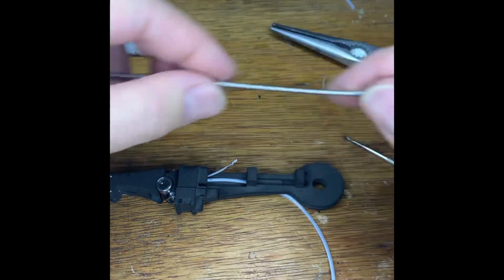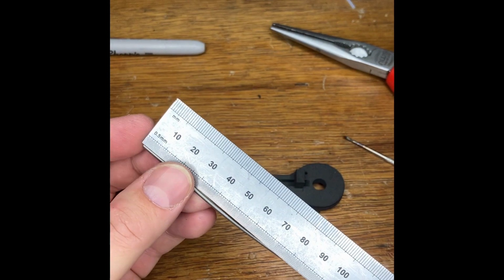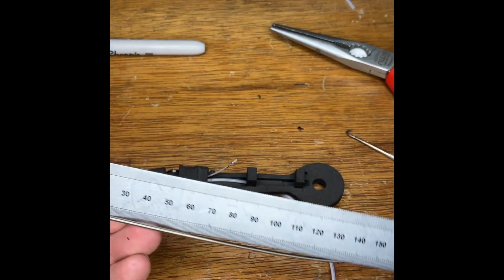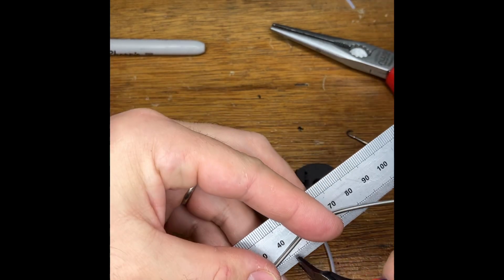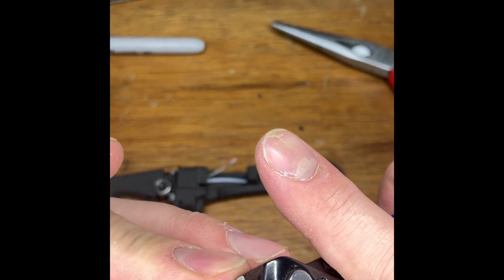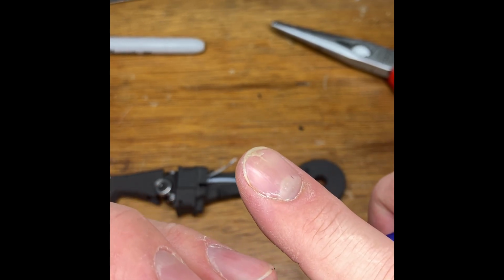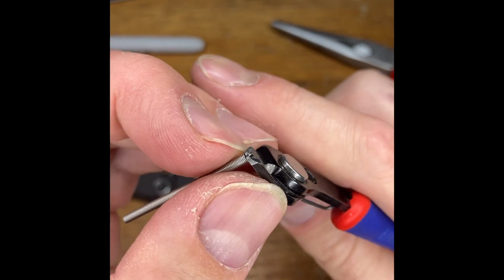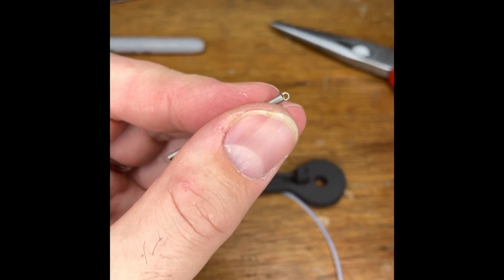Now take a length of spring. This is going to end up with about a 30mm spring. So we can cut off more than 30 to get started. It's a bit easier to work with. So I say 40. This then needs to be made into a simple loop or hook to catch the knotted tendon. Like so.